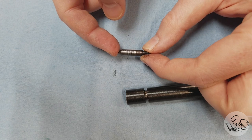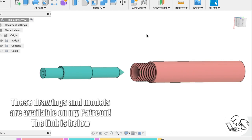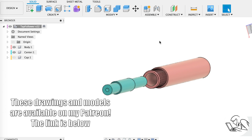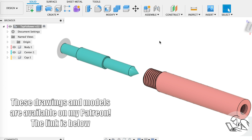We're going to fix all of that with this new design. This one has a single-piece pointer so there's nothing to unthread. The key to this design is that the hole for the pointer is in the solid end, so the cap that unthreads is in the back. I've also added a small negative center in the far end so the pointer can be removed and reversed for use with small taps. The one-piece design at the business end should allow excellent concentricity and those two points of support against lateral loads, which should make for cleaner, straighter threaded holes.